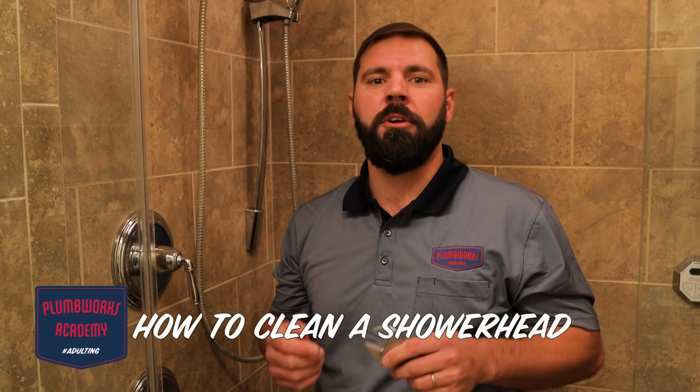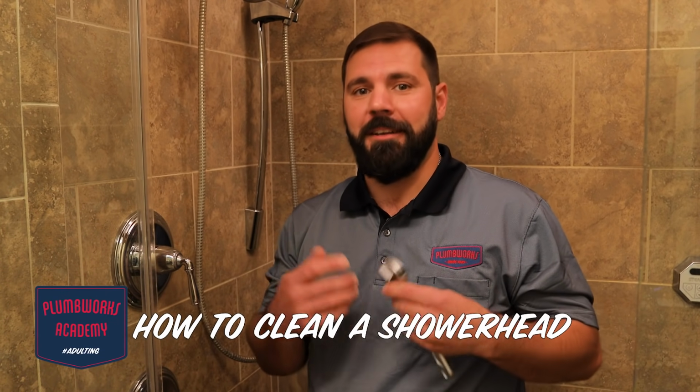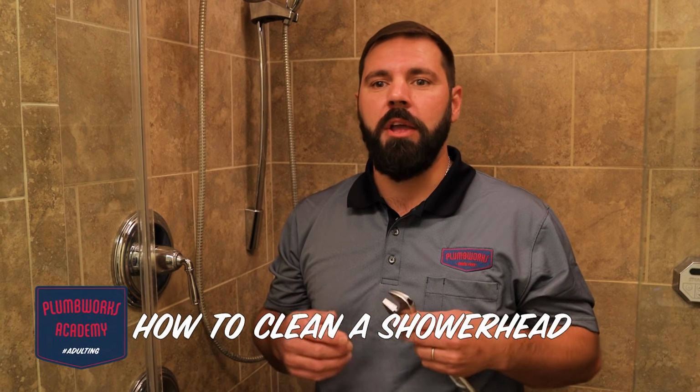Today, we're in the master bath shower, and we're going to show you how to clean your aerator in your lavatory and also clean your shower head. Let's go ahead and get started with the shower. Today, we're going to learn how to remove your shower head and clean your shower head. A few of the reasons why you may have to do this is because you have a buildup of calcium in your shower head and you're not getting sufficient flow.